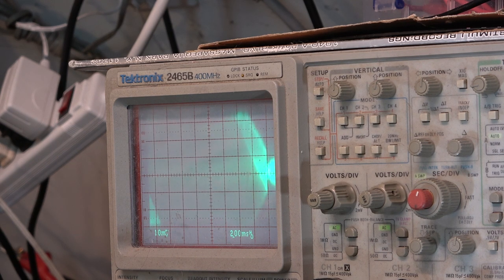First of all, set the tracking control in the center. Okay, tracking control's in the center, and then I'm going to adjust the tape guide here ever so slightly with a screwdriver of the right size. And that's it. See? That's all it took. It was just to crack that over just a bit. Just like that.